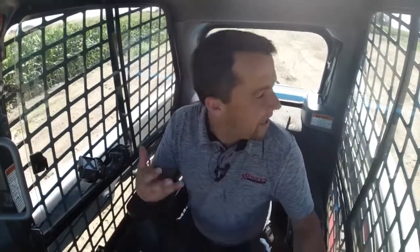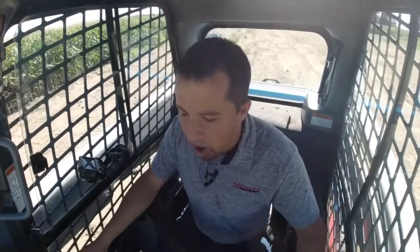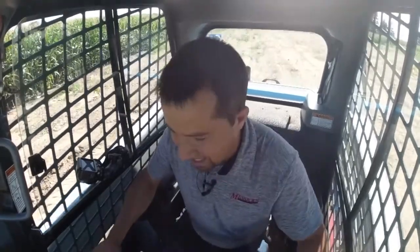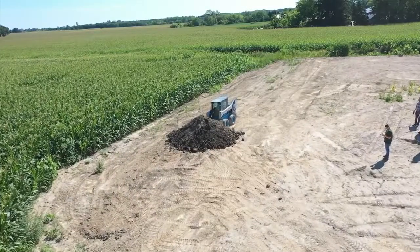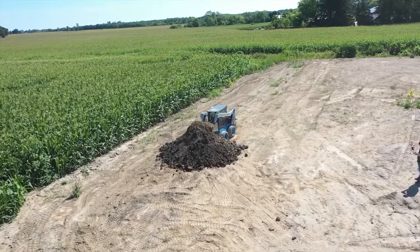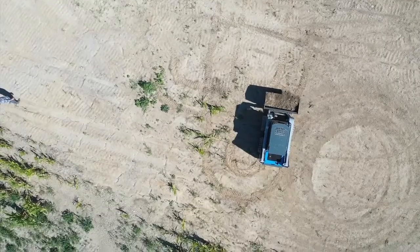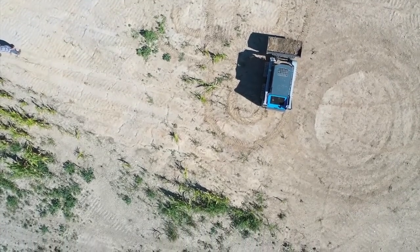Now, another ride control thing that happens here is when we push into this pile of dirt, and when you have that accumulator turned on and you go to dig, so there I'm on, oftentimes that sponginess in the boom causes problems for you when digging. And you can see a little bit of bounce of the boom as I'm coming up and out of the pile of dirt. But I can still get into the pile and really bury it and really fill it quite well.